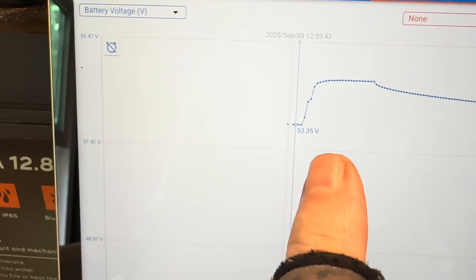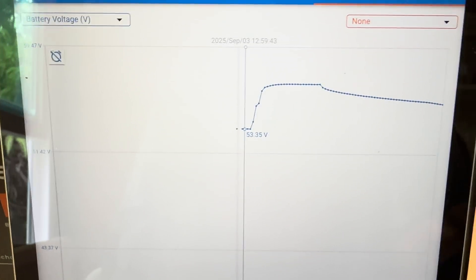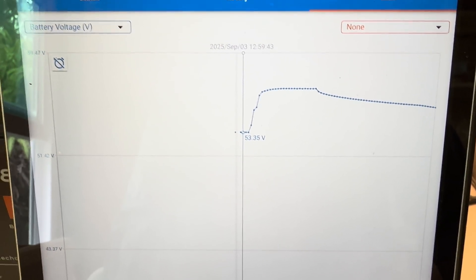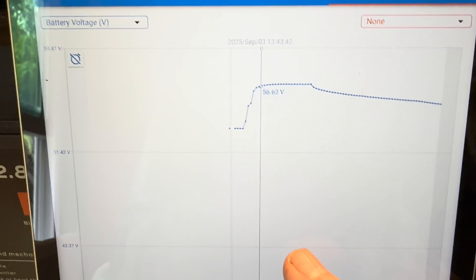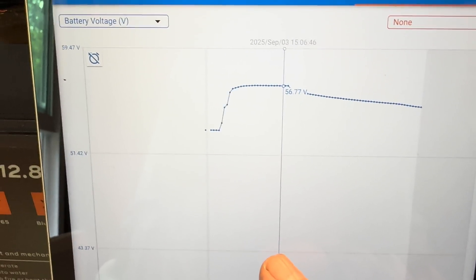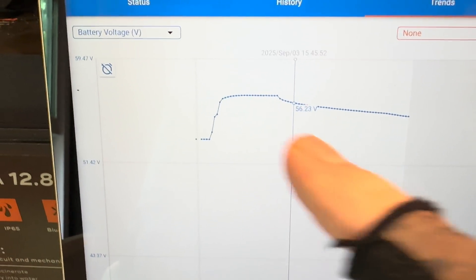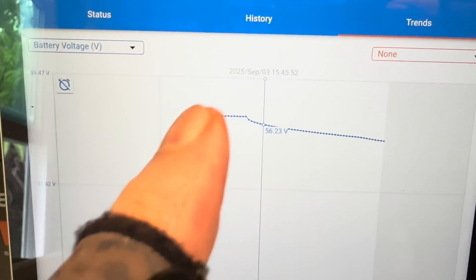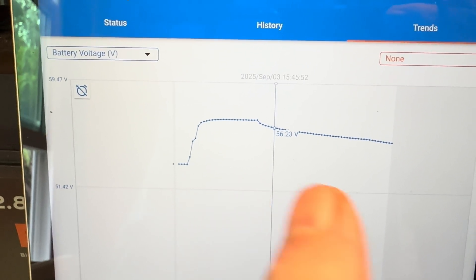Then I hooked it up yesterday. I was originally just going to try and do a long, slow charge at about 55.2 volts. But as you can see if I scroll, it went right up to 56.8 — it never dropped. Then towards the end of the charging day, after it was a couple of hours in absorption at 56.8, it settled down throughout the night and looked good. I didn't get any weird BMS cutoff or anything weird like we were getting when it was hooked up before. So I was kind of pleased with that.